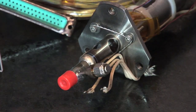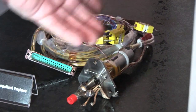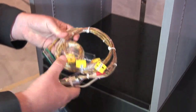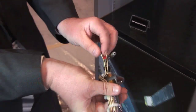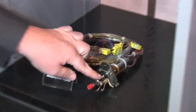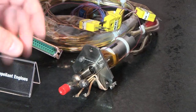You've got a valve here — same as the propellant management assembly, where you apply voltage, the valve opens; you remove voltage, and it closes. Temperature is very important. This is actually a test engine, so there's a lot of instrumentation hanging off it. You can see these are thermocouple ends — these are thermocouples here and here. During testing, that allows us to understand the temperature of things. Back here it's very, very hot; back here, you don't want it to be very hot, so there are things associated with the design to manage that.